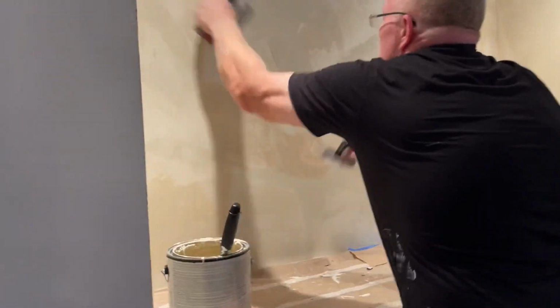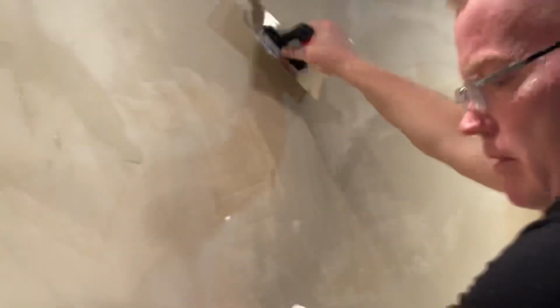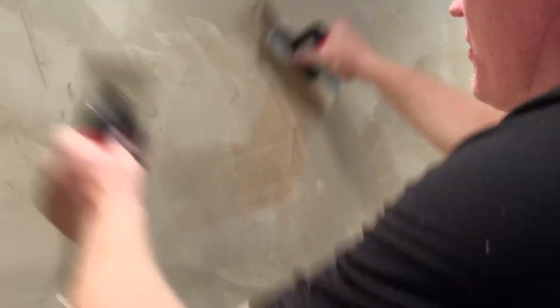Can you bring them in close? With this motion, this double motion, I'm creating a greater amount of friction on it. I'm challenging the Venetian plaster to shine more by going this way and then this way. It doesn't give it a chance to cool, so to speak.